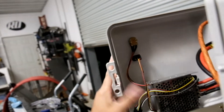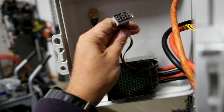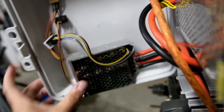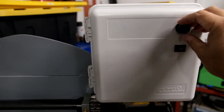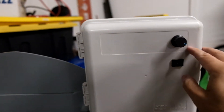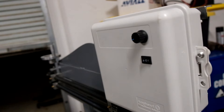There's one more feature that this speed controller has. It's just on there with double-sided sticky tape but it's kind of falling off. There is a display. I was going to cut a window here, but that number is like totally arbitrary — it's zero to 100 in percent of basically where the rheostat is set. So if the rheostat's all the way open you get 100 percent; if it's barely on, you get one or whatever. I'll probably do it in the future just because it'll look cool. But really, I'll just look at it — I'm going to put some labels on here. I'll put 100 here and 50 there and then I'll know where it's at. There's really no need for it, and I wasn't sure I could do it cleanly anyway just because of the way that little screen is — there's like no way to mount it cleanly.